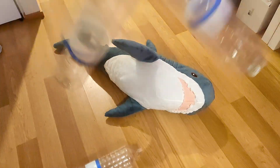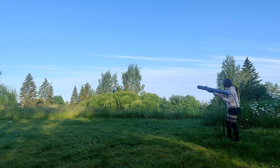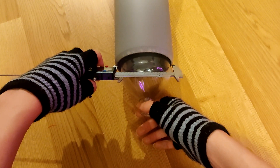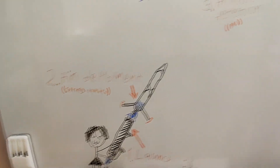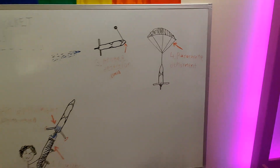In the video where I built the rocket launcher itself, I also spliced some empty soda bottles together to form these rocket sections, which I could launch out of the launcher, but they were unstable because they didn't have any fins, as I couldn't install any directly onto the rocket sections. The main problem was that the barrel and bottle didn't have enough tolerance to allow any fins to fit, so I decided to improve the system so that the fins deploy after launch, after which the rocket detects apogee and releases a parachute.